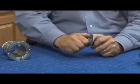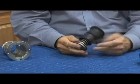Go ahead and tighten this. Get your small adjustable wrench. Tighten that bolt, making sure the second O-ring is loaded.